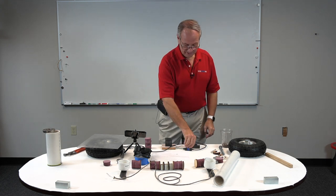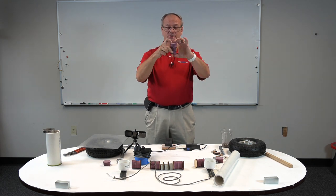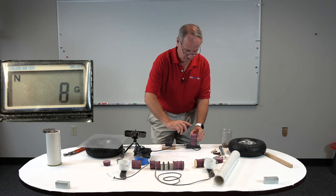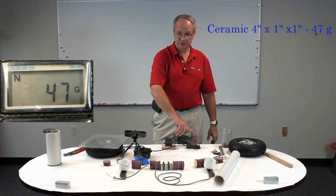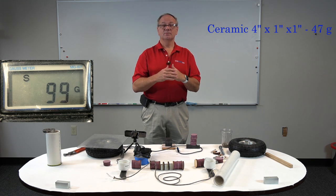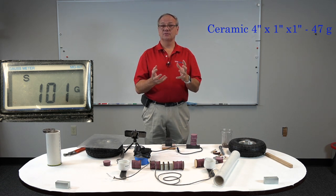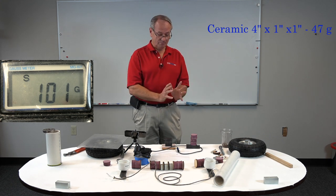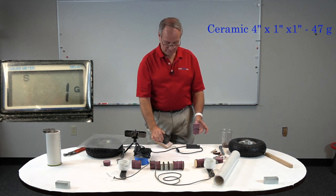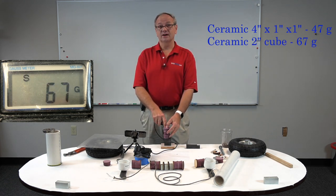This is a four by one by one ceramic magnet. I have a stack of styrofoam here to get us a gauss reading three inches away — it's three inches from top to bottom. When we get our reading at three inches away, we're getting 47 gauss. For those that have worked with magnets before, it takes about 50 gauss to pick up basically a paper clip or a small nail at that distance. So we barely at three inches away that magnet would pick it up. I also have a two inch cube in ceramic, and we're getting 67 gauss on the top of this.